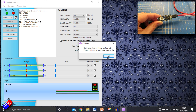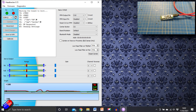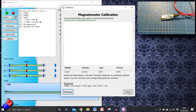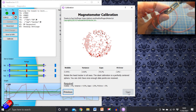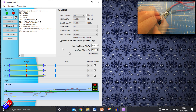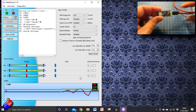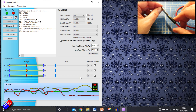Calibration hasn't been done yet, so we'll do that first. Place the board on a level surface and wait for everything to settle down — everything will drift initially after first boot, so wait for the offset values (the blue ones) to completely settle before hitting next. Next is magnetometer calibration, where you just flip it round and round until it allows you to save. Once done, moving it around on the desktop shows all the different values moving. You can then configure channels, PPM output pin, centre button, range, and gains — everything is configurable, though I've left mine as default.